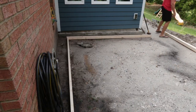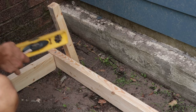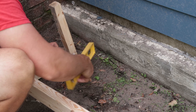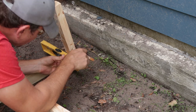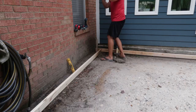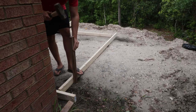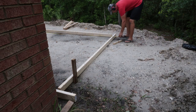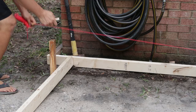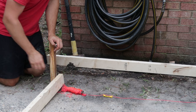The first thing I did was lay out the perimeter form. I wanted to match the pitch of my existing original concrete slab, which in this case was about a quarter inch per foot. Then I mounted the form board to the stakes I put in the ground, checked the pitch, and used it to set the other perimeter forms. To get the correct level and pitch on the opposite side, I simply used a line level to match the form board on the other side.